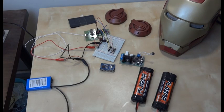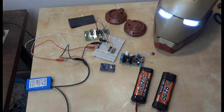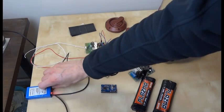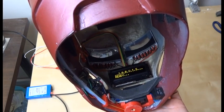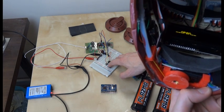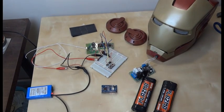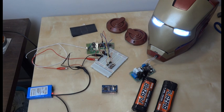Let's see what we've got in terms of electronics. I've got the helmet here - if I turn that on, the eyes illuminate for a bit and then they should go off again. The transmitter electronics are basically this piece of board that's just got a voltage regulator and two switches on, and there's a microcontroller and a wireless transmitter. If I turn that on, it transmits to the helmet. It transmits to the display in the helmet that everything's ready, and if I scroll through with these buttons we can operate different functions - open, close the eyes, and one for the unibeam. If I go to open and then hit the select button it opens the faceplate, and if we scroll through to close again it turns on the eyes for four seconds and then they turn off again.